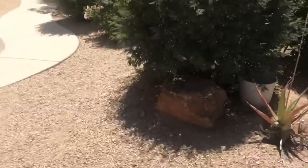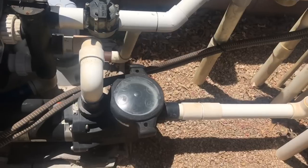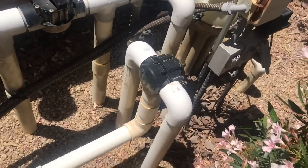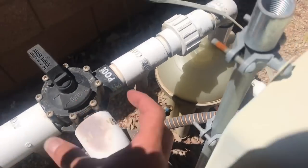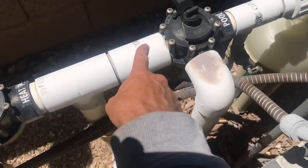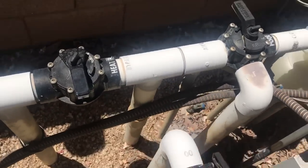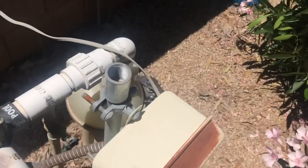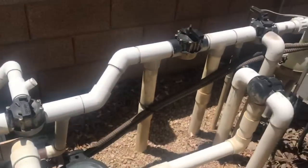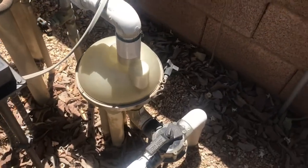Let's head over to the filter area to see the differences. First thing you notice: there is only one motor. That means this pop-up system shares the return flow with all the other ports and valves in the system — including a deck chlorinator, an aerator, a heater, and a spa. When you have a system like this that shares pressure with all the other valves, you have to make sure there's enough pressure going to the pop-ups to get them to work properly.